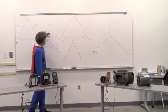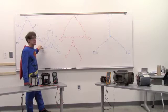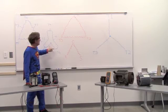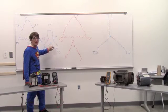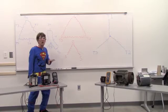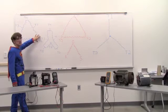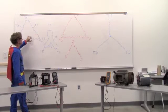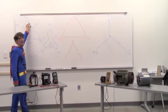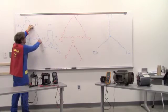I can also have a configuration like this, where I have now six leads. You notice I have two sets of windings here. In order to meg this, I have to physically disconnect these sets of windings to do that. So when you're megging a motor, you want to disconnect all the leads. Also, I have another one over here, a delta wound, showing it in just a different configuration with six leads as well. Each one of these represents a set of windings. In order to meg the windings to windings, I would have to disconnect them here and isolate the windings from each other.